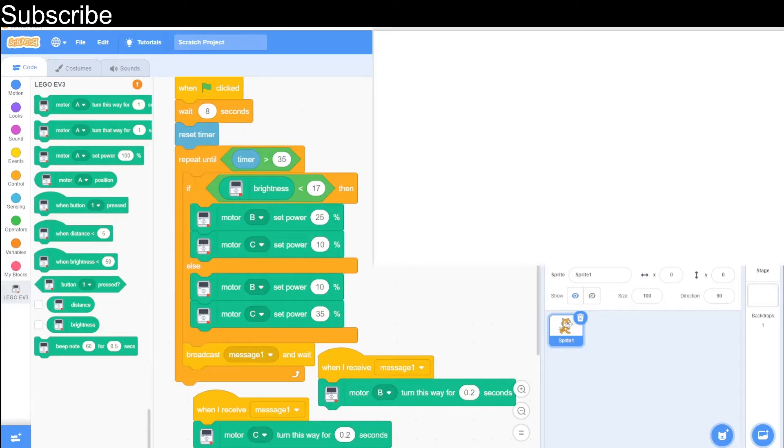To understand the concept of line following a bit better, let me do a simple drawing. Say we have a black line and the sensor is sitting on that black line. What the robot is going to do is always steer slightly to the right. Then when the sensor reads white it is going to steer slightly to the left, then when it sees black again it steers right, and so on. It won't be as extreme as this drawing but that is how line following works — it steers one direction, sees a colour, and steers the other direction. You might think it simply follows the line straight, but actually it follows the line in a zig-zag motion.